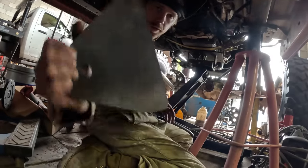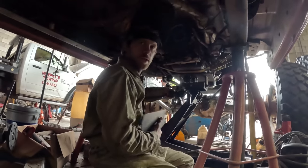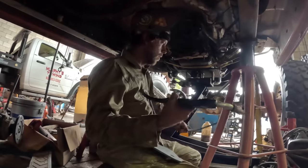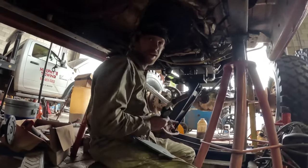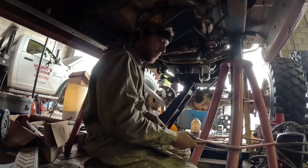I just pressed a button with my hand. Is it you messing with the machine? Someone keeps messing with it. Putting it at 15 volts at 100 wire speed. Really? Yeah, there's no fusion, I don't know what you're welding with that.